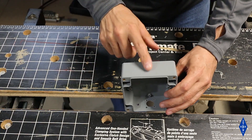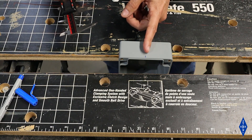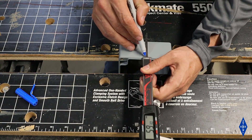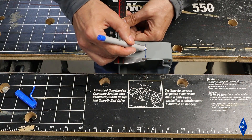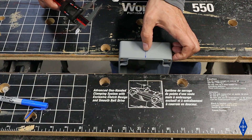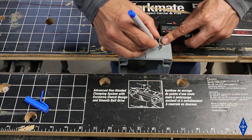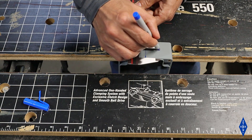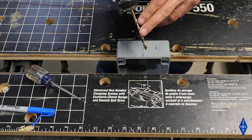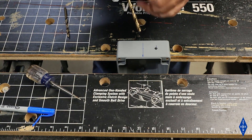Next I'm going to flip the box over and drill a couple of holes in the bottom. The first hole is for the strain relief, so I want to put that right in the middle — I've already found the center line of the box in the long direction, now I'll find the center line along the thickness. The second hole on this side is for the antenna connection, splitting the difference between the edge and the center line, in line with the strain relief hole. The antenna connection hole needs to be 5 millimeters or 13/64ths inches in diameter, and the strain relief hole needs to be 6 millimeters or 15/64ths in diameter.